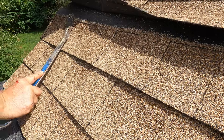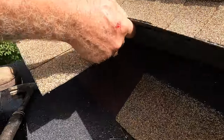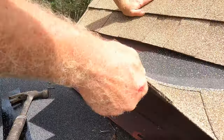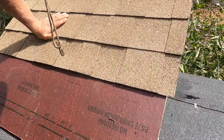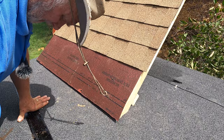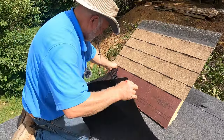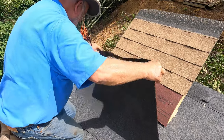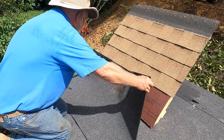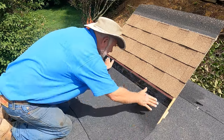Remove these shingles. I already have a base up here — bring your membrane up, remove the plastic, and stick it on there, just like that. At least two layers up, and that's it.